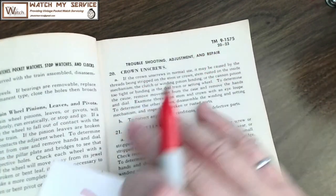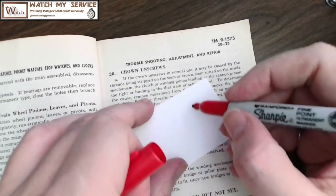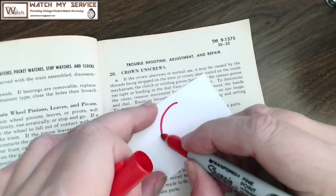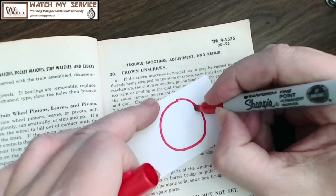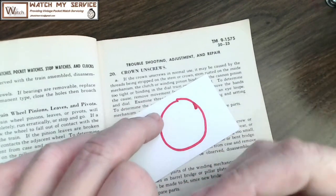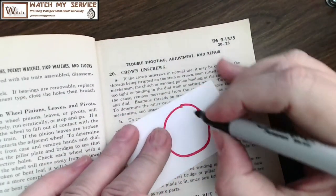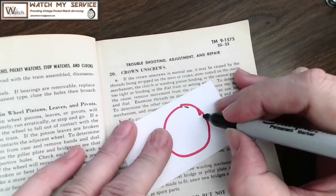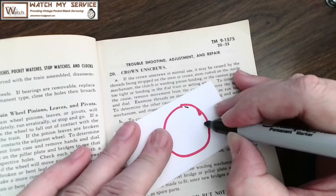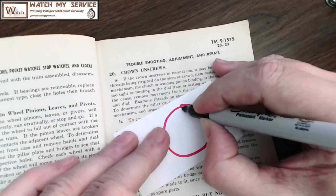And then on the barrel of the mainspring, you can have the barrel on the outside. Draw an outside barrel. So there's the outside of the mainspring like that. And you can have a hook on the barrel like this that catches the mainspring. I'm going to go reverse colors on you. And then the mainspring comes around. I put a mainspring in the other day that had a T opening like that. And the mainspring comes around like this. It hooks onto this hook, and then it keeps going around in a circle, right?